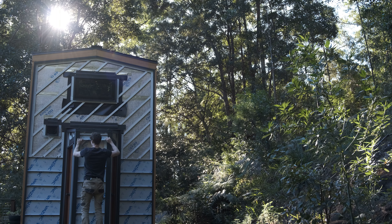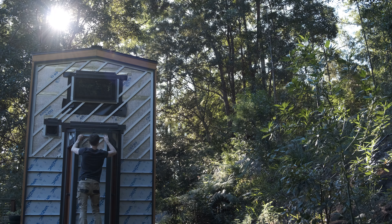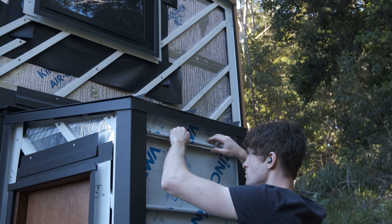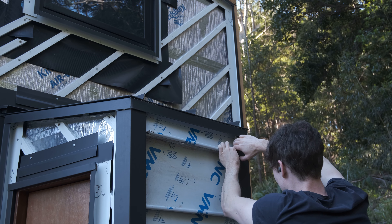This panel at the top of the box is a bit of a pain. I put it in first and push it up into the top flashing, then flatten the clip for the seam and install the second from top panel. Once in, I can fold the clip over the panel I've just placed and try to pull the top panel down to connect the seams, which is easier said than done.